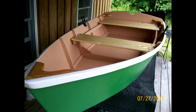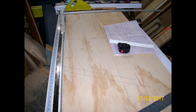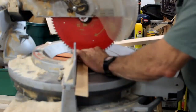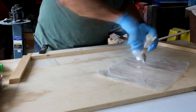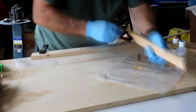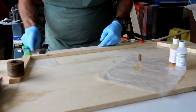There's a picture of the boat when it was finished — the 8-foot frugal skiff. Then I start laying out the lines on a piece of plywood on a flat surface, drawing all the components full size. I start cutting out the components and lay all the parts right on that drawing, aligning them perfectly. Then I can start gluing them together — but of course, make sure you put some wax paper underneath so you don't bond the components to the plywood. What I'm building now is the mainframe — this particular boat only has one — and that helps define the shape of the boat when the hull sides start going together.